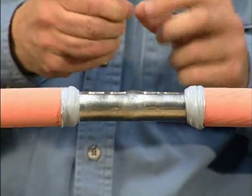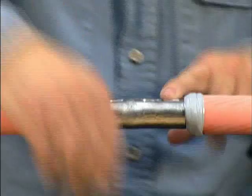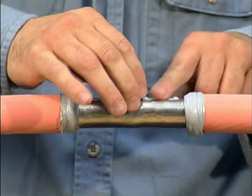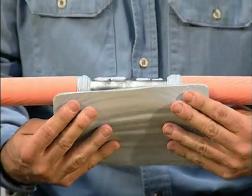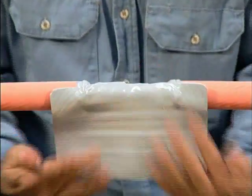Fill the indents on the connector with small pieces of gray mastic. Then wrap the mastic pad from package HP A2 over the connector. The pad must overlap the insulation on both cables equally.